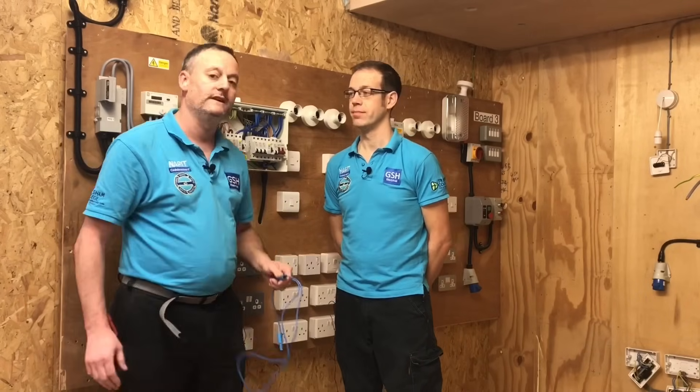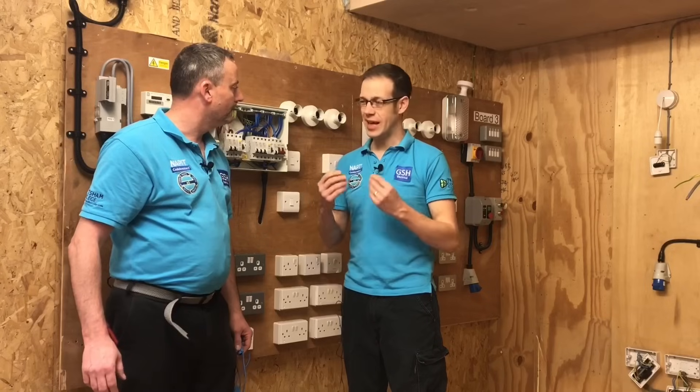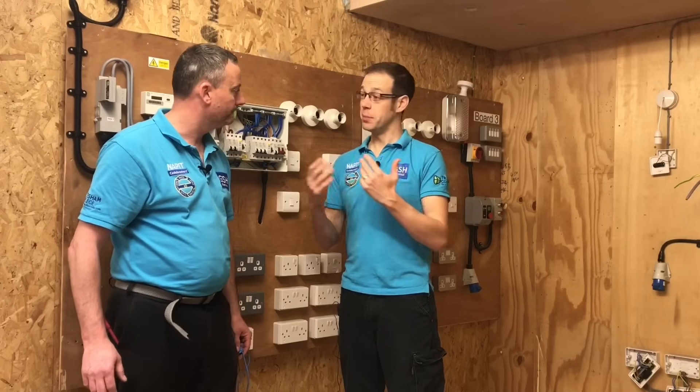The piggybacking lead makes it easy to connect live conductors together to earth and record that reading exactly as BS 7671 requires. What we didn't cover in this video was operating the two-way switching to make sure we've insulation resistance tested every single piece of cable - that's an important issue we want to cover in detail in another video, as there are implications for doing that in the real world and also for the AM2 and AM2S assessments. We're going to make a separate video presentation going through what's expected in Guidance Notes 3 for carrying out the insulation resistance test where there's two-way or two-way and intermediate switching. This video was all about showing how simple it is to use a modified lead to carry out the test, and we hope it's been of some help.